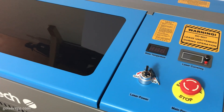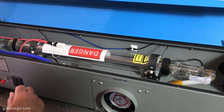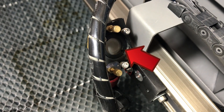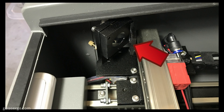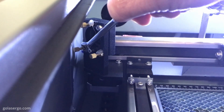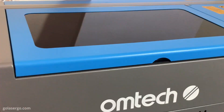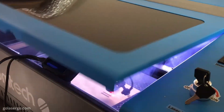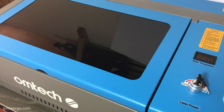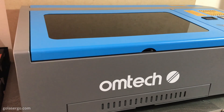And the cons? It's heavy so you'll probably need two people to move it and a solid surface to hold it. You'll also need access to the back of the machine to adjust the mirrors or check the laser tube, so be mindful where you place it. Adjusting the mirrors can be a bit fiddly, however there is a video on the included USB stick that takes you through the process, and I'll add a helpful video tutorial link in the description below. The safety lid is great at protecting your eyes but you can't see through it, which is why we set up a camera and a light inside the machine. There is a big learning curve, but it's well worth it if you want to try out a CO2 laser for the first time at a reasonable price. Thank you for watching — if you've enjoyed this please give us a thumbs up and subscribe to the channel for more.